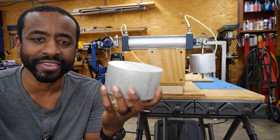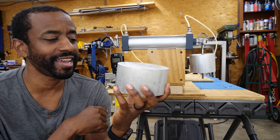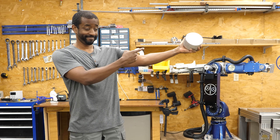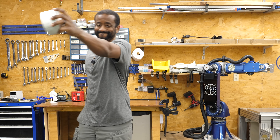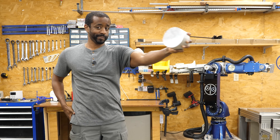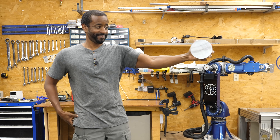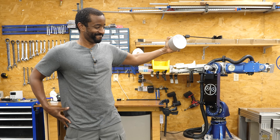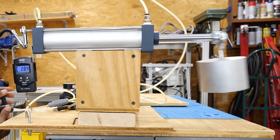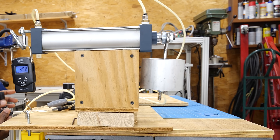Here's a great example you can try at home. Grab something a little bit heavy — a gallon of milk is about eight pounds or four kilograms. Extend your arm straight out, then swing it forward and to the side as quickly as you can. Immediately you'll see just how difficult this is because moving it very slowly you feel almost nothing — it's just the static load of trying to hold the weight up. But now you've got an additional force trying to accelerate the mass. The take-home message is: the faster you try to move things, the greater the forces on your machine.